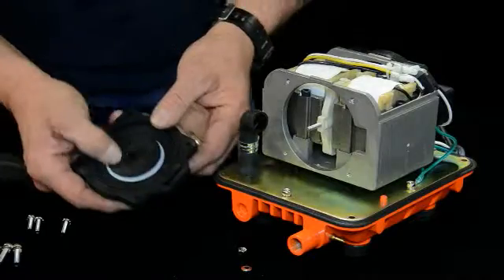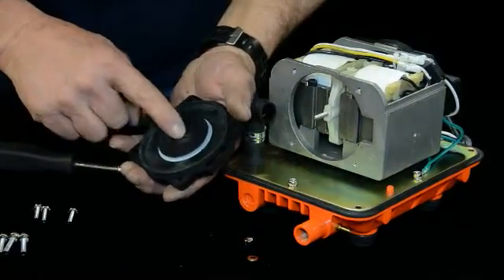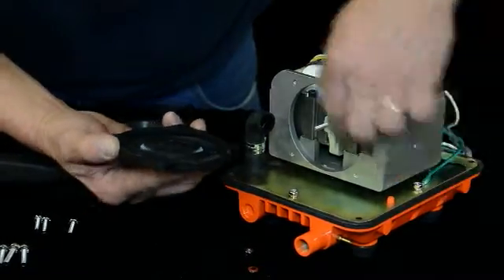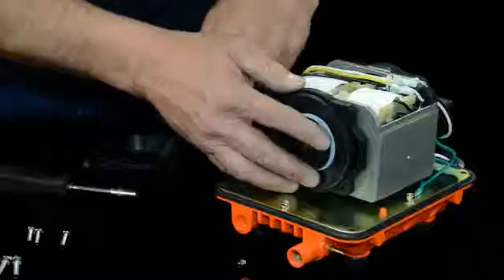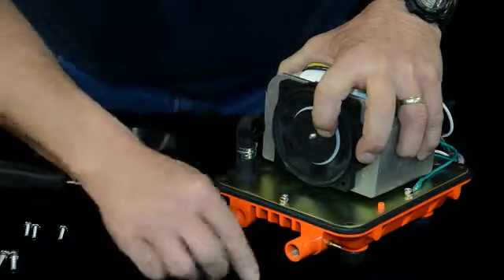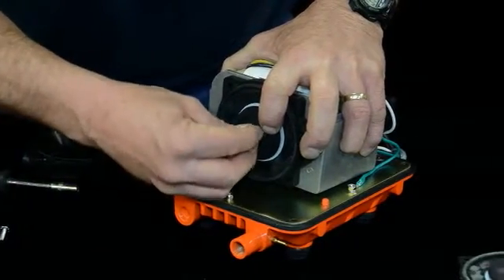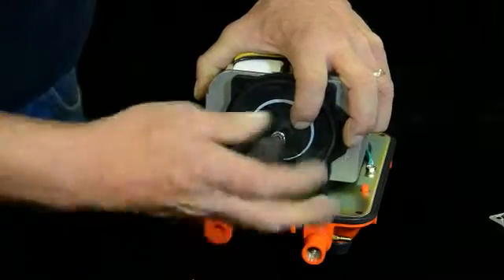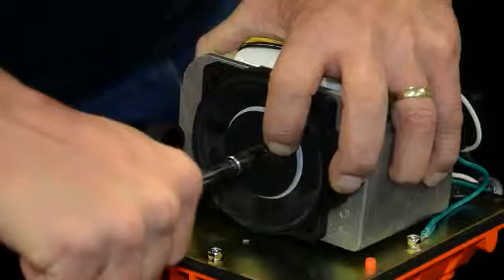The diaphragm — you can tell this side goes to the shuttle and the other side is where the washer and nut go on. When you put it on there, there's a little offset here. Just match up the offsets with the face in the shuttle. Just snap it right in there — nothing to it. Then put your washer and nut on there and tighten them down nice. It's a lock nut so it'll stay in place. Just tighten it until it's tight — don't have to overdo it and strip it, just a good tightening.